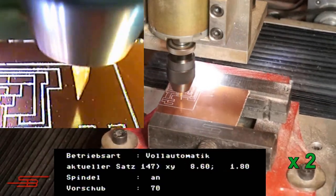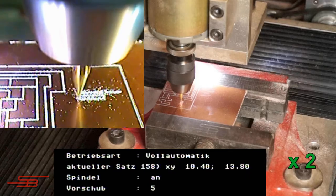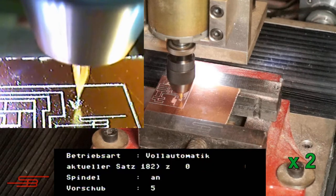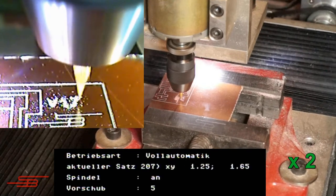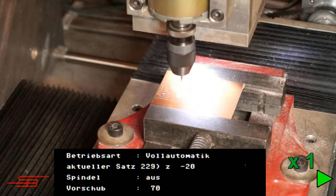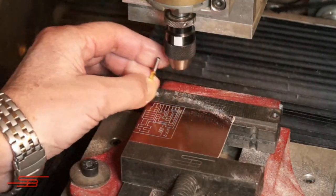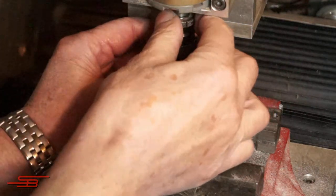Now follow the last lines of the engraving program, where my logo and the PCB version number are engraved into the board. These program lines show that the C64 and the CNC program can also engrave curves and slanted lines. Finally, all the holes for the various components are drilled. I use a 0.8 mm carbide drill for this, and it is an enormous advantage to have the CNC machine.